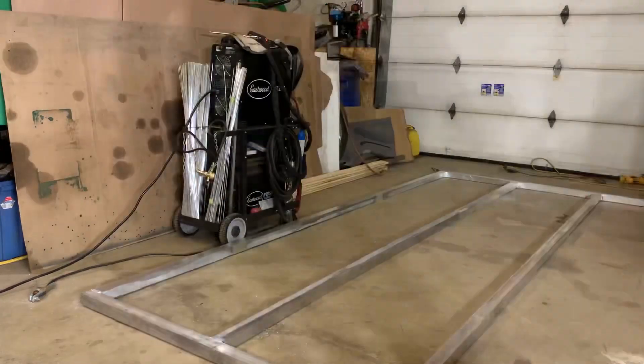What have I forgotten? Actually, before I move on to the step of pressing the floor pans into the frame, there is one thing I do need to do. It's nice that this is a slow build because it gives me time in between jobs to think about things I might have missed or want to change. I realized I haven't inserted some sections of pipe into the frame as a second mounting point for the legs. I need to cut some sections of pipe and weld them in — so yes, more welding.